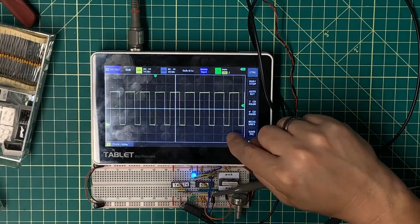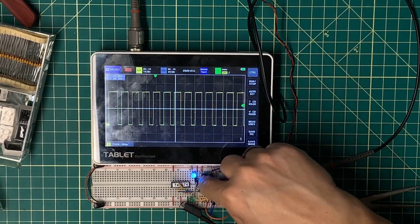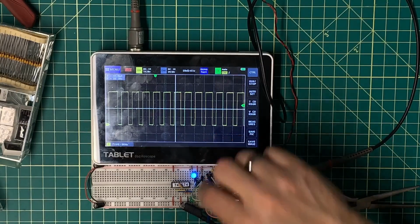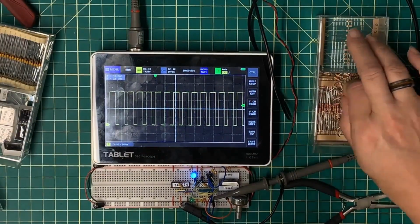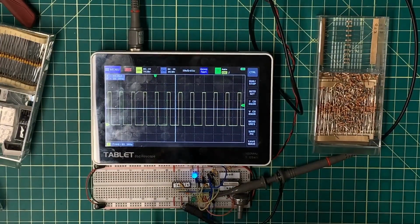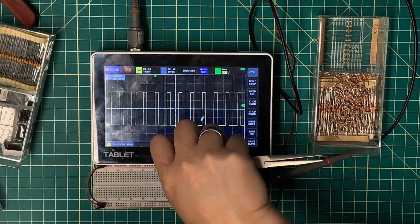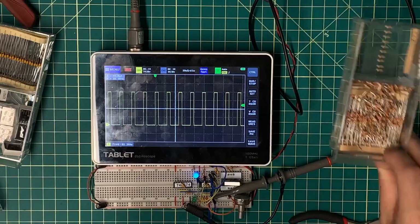Okay, that's oscillating just fine at a frequency of 80 times per second. Now these are 1K ohm resistors, and I can drop those down to, say, 220 ohms, and I think get a better response. So let's try that. So that's 81 kilohertz instead of 81 hertz. So that's actually really a nice speed. I like that speed. Now I could probably put 100 ohm resistors in there and get maybe twice the speed, but I think that'll work just fine.